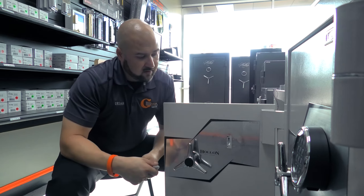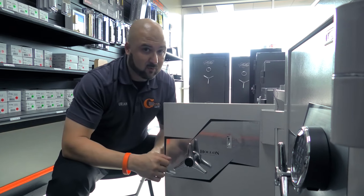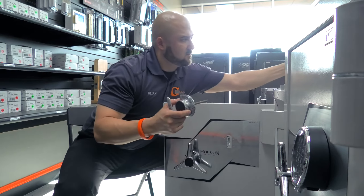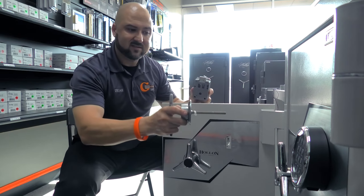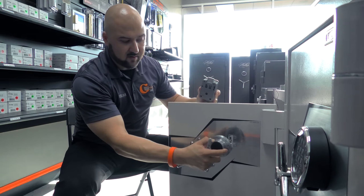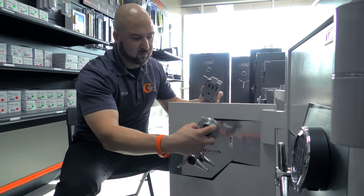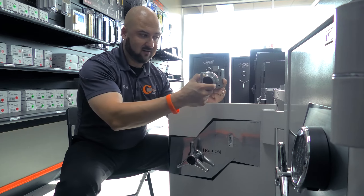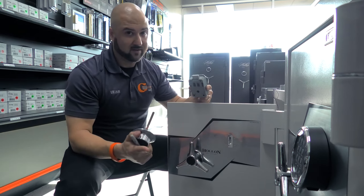I've already marked where the new holes need to go. There's metal and then concrete behind it, so I'll drill through the metal and just a little bit into the concrete, then use small self-tappers to grab the metal and hold the dial onto the front of the safe. I had to double-check everything off screen because these holes were not centered — they didn't plan on us swapping it out. The spindle that goes through has to screw into the lock pack and cannot be at an angle or rub against the wall.